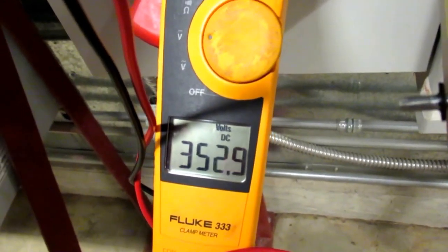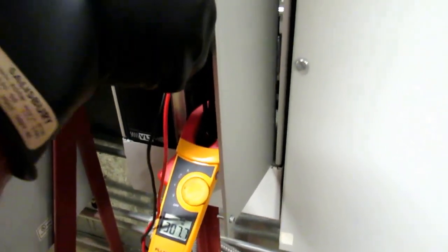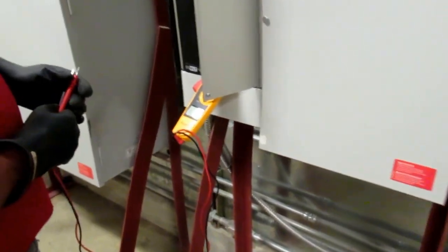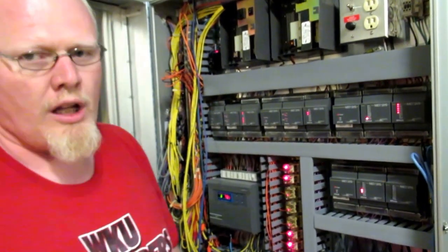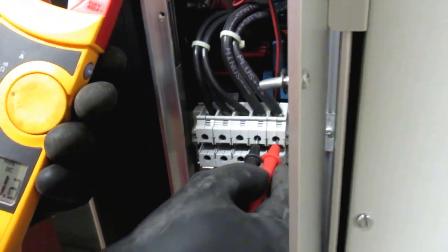You can see we're still at almost 400 volts and falling — 340, 330. It does take a little bit of time for that voltage to bleed off of these drives. Different drives and different types of motor controls will have a different time period for that voltage to bleed out. It's also possible that control voltage or other types of voltages may be present in a panel depending on the system. In industrial controls especially, you will see control voltage fed into one panel from another panel. Never under any circumstances should you trust any electronic control to keep equipment off — always use your lock and tag. Even after significant time has passed, we still have over 200 volts in this drive due to the capacitors holding the charge.